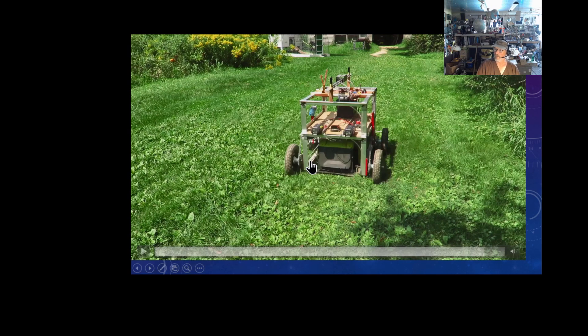The reason I had to add this RTK lock feedback on the rover is that I would just suddenly drop the RTK — no rhyme or reason. It could be close to my transmitter, far away from it, clear blue sky, and still it would just drop. It wasn't really a receiving problem. What it was, I found out, was my funky Wi-Fi in my shop.